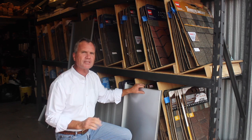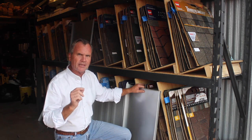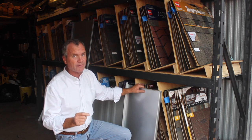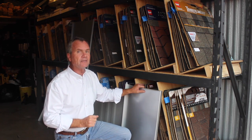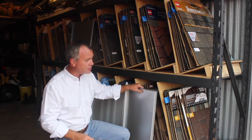Today we're going to talk about metal roofs — standing seam metal roofs — and what the difference is between non-striated or flat panels, most often called flat pan, standing seam metal roofs, versus striations, or a pan that has striations.